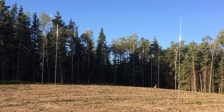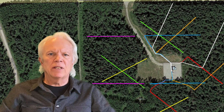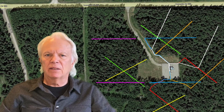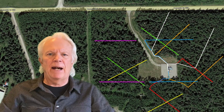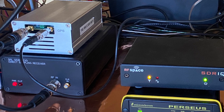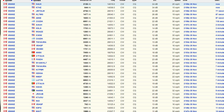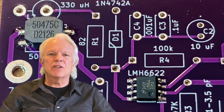There's no need at all for a preamp before the rig. The slight modifications to get them to work with my BOGs has also surprised me — they're remarkably quiet, and they're perfect for use in my phased arrays because they stabilize the output impedance to exactly 75 ohms, no matter what's happening on the BOG wire. I've even tamed one of these amps for use in a short 15-foot dipole on top of my tower, now my main broadband amp feeding the nine-band skimmer used for 160 meters through 10 meters. Maybe build a few of these amps and experiment with them. 73, this is Steve, V6WZ.